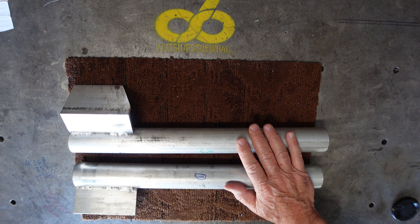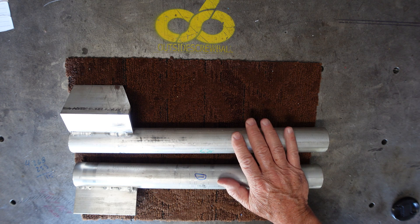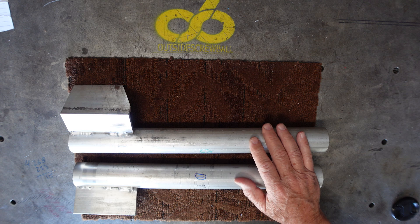The tungsten was turning blue. So I did a quick search — why is the tungsten turning blue? It turns out you shouldn't be using thoriated tungstens on aluminum. You should use 100% tungsten. Well, I figured that out, went at it again, and I was still getting nowhere.